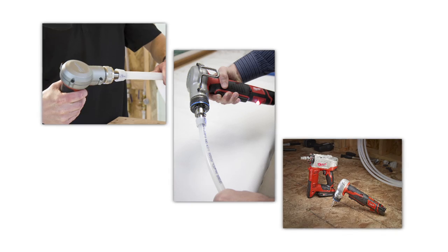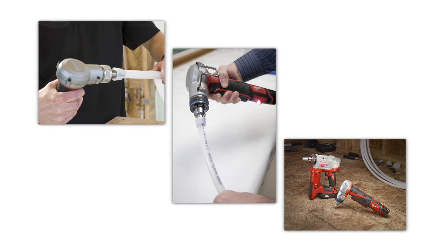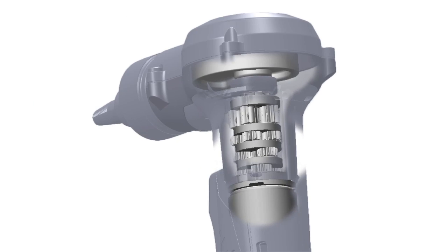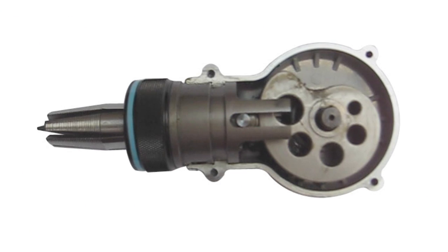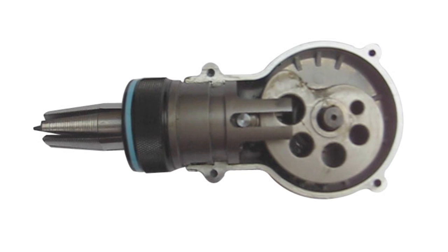These new tools deliver a four times faster expansion speed, which reduces the expanded tubing return time. The built-in auto-rotation feature eliminates grooves along the axis that can slow sealing times. The specially designed elliptical cam drive matches expansion rate and force with the unique properties of Uponor PEX-A tubing.